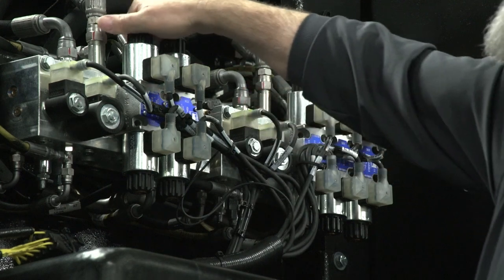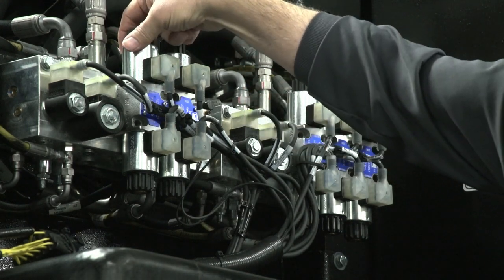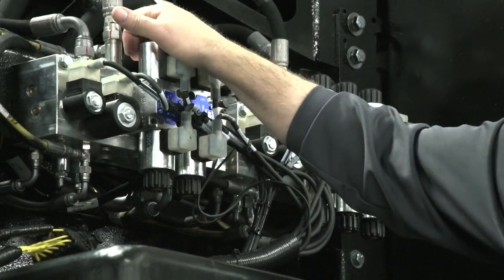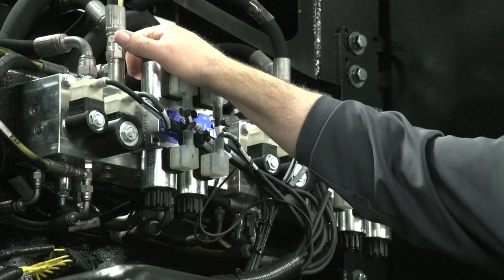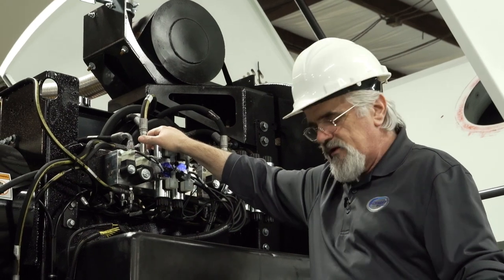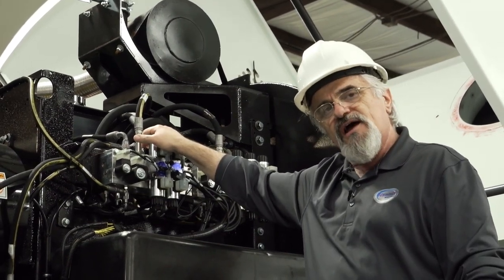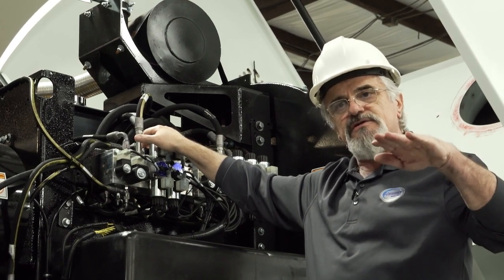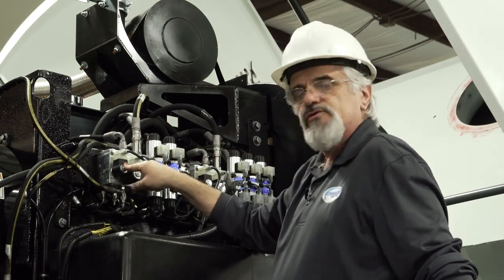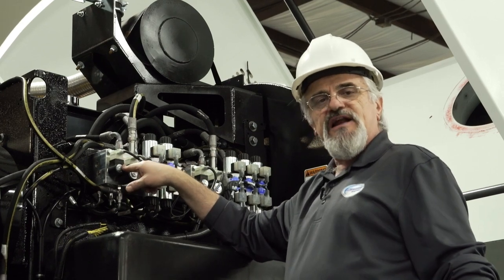The magnetic coil on either side of the directional valve magnetizes and opens the valve to allow the flow to go through. If the broom does not drop and just stands in position and spins, that means there is no power going to the lock valve, or if there is power going to the lock valve, the lock valve is not opening.